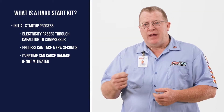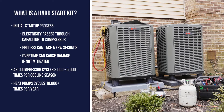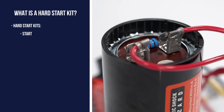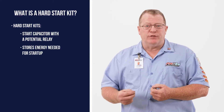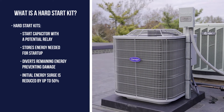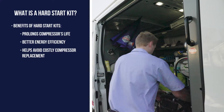Think about this. During the average cooling season, air conditioners will run between three and five thousand times. Heat pumps will run double that over the course of a year. To put it simply, hard start kits are used to help ease the startup process for air conditioners and heat pumps. Hard start kits are a start capacitor with a potential relay, which means it does two things: it stores the needed energy until startup and diverts any remaining energy, preventing further damage. So with a hard start kit installed, the energy surge is reduced by as much as 50%, resulting in prolonged life of the compressor, better energy efficiency, and helping you avoid costly compressor replacements.